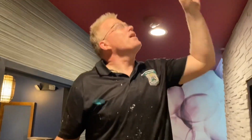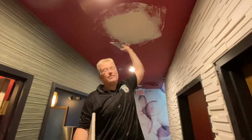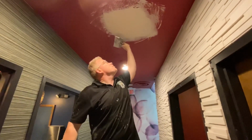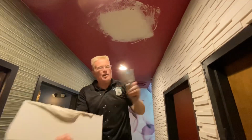And I hope I didn't over-explain it. I want everybody to benefit from these videos, and this is something that you only figure out when you're doing this kind of work. The do-it-yourselfer goes on YouTube, tries to figure out how to do it, and the person giving the video doesn't explain this very important detail. So the moral of the story is get yourself a wide blade when you're having a small repair, because the bigger the blade, the better your repair is going to look.